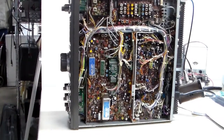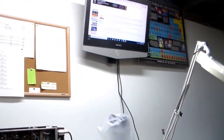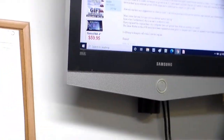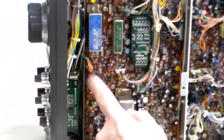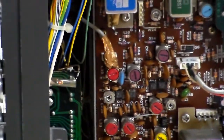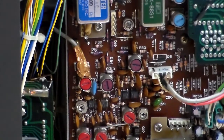When I did a search for it, I found a fellow who had something posted on QRZ — his callsign is Alpha Delta 8 Bravo Uniform — and it was just posted on April 17th of 2020. He described almost the exact same problem I had told Chris I experienced. He found a bad solder joint on the board near L35, which is a transformer, and it's right here. Where he circled is actually a connector that comes from the CAR2 board.